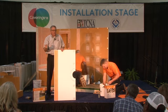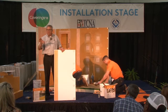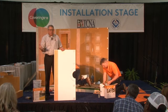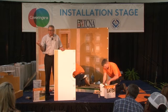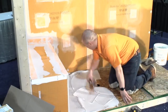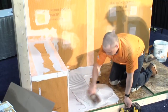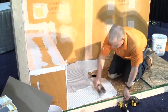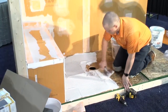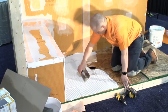what you don't need. What if you put the tray in place and there's still some room to get to the wall? You need some extra. Well, a couple of options. You can use standard dry pack mortar in there, or you could use Kerdi-Board of the same thickness as a filler. Of course, you want it to kick a little bit, so you'd spot mount the Kerdi-Board in there and press it down with a straight edge to continue the slope with your filler piece. So two options: mortar bed or some Kerdi-Board of like thickness in order to get yourself a filler.